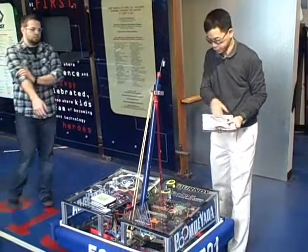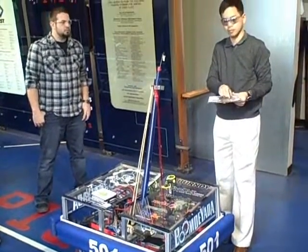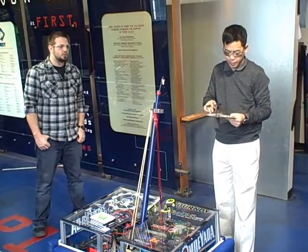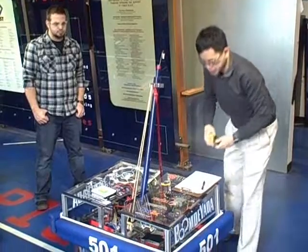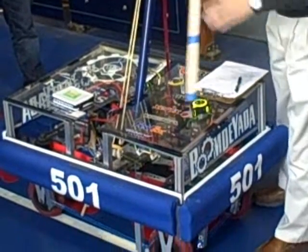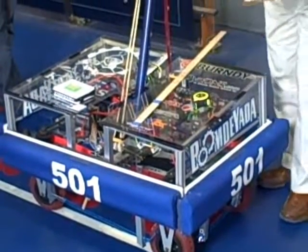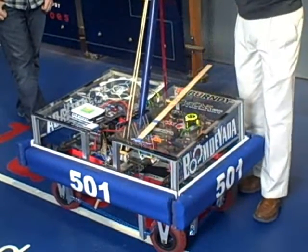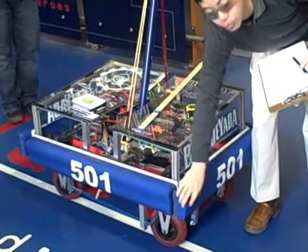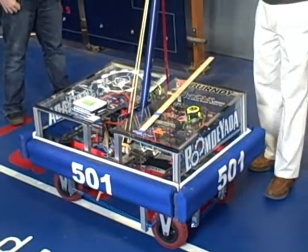The bumper segments must be at least six inches, so that's basically looking at each one of these pieces here. Each segment has to be supported by the robot itself — you can't have sections that are basically going to go inwards as they're getting hit. You can have a certain amount of gaps between them; that's fine. Make sure that the bumpers extend fully into the corners. The fabric itself has to wrap around to be secure, with no looseness. Team 501 here has a velcro system that also allows them to interchange their bumper covers — also allowed.